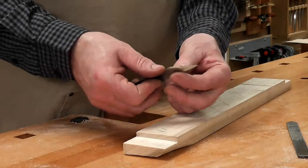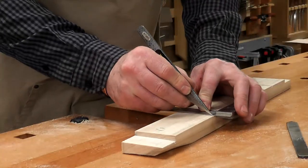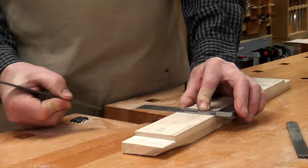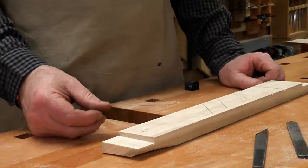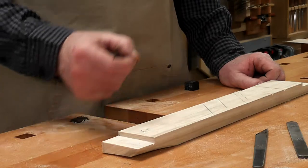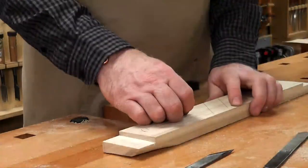And you can get these like a razor blade. They are nice and sharp. They have a nice stiffness to them to make it easy to use, okay? Some of my stuff, if I do things like hand-cut dovetails, I'll go back to using a scalpel, which I need the thinness to get in there for my heavy-duty marking. I'll get away with that.